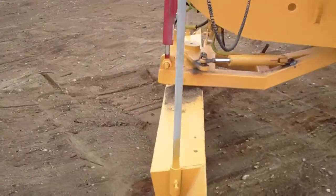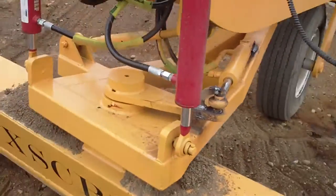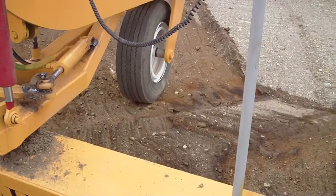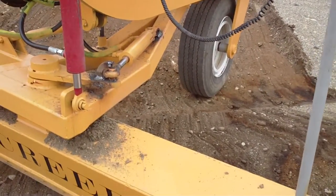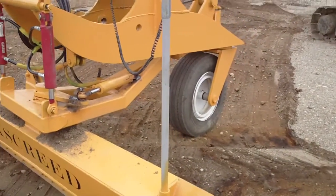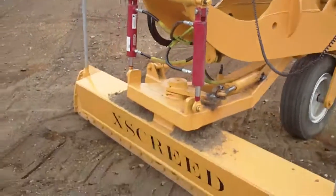The cylinders give us 10 inches of travel here — you can see a little bit of silver showing. When you're running the machine, you kind of look at how much pressure you're putting on the tire, because the tire will pick the machine up. It's better to run the machine farther away from you, as far from the excavator as you can, just to help reduce the tire lifting the excavator if the operator is getting a little behind in controlling.